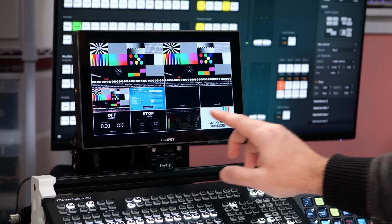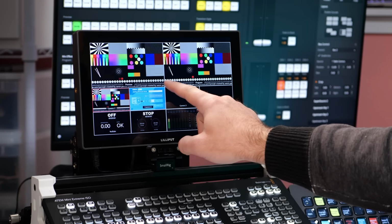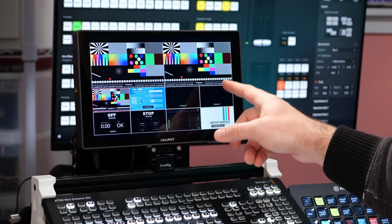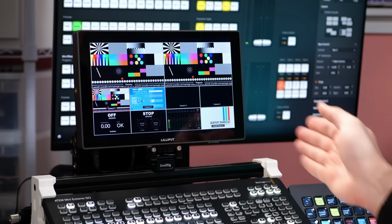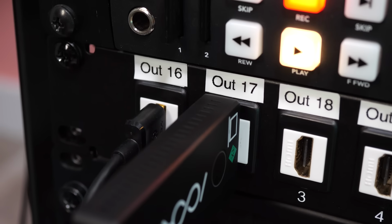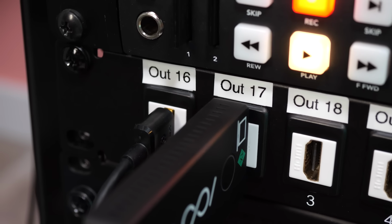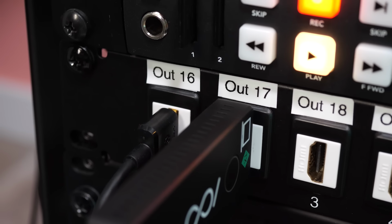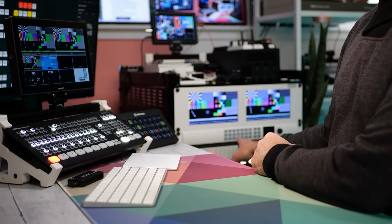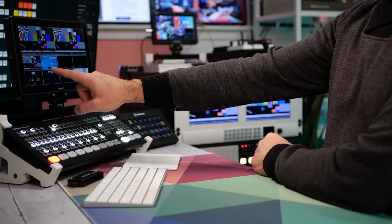So what I'm going to do is play back the stress test clip. This has a little frame counter at the bottom, so we can freeze frame this by taking a photo or pause the video to see how far apart they are from the two sources. But because I want to see only the latency added by the wireless link and ignore any latency that might have been added from other gear here, what I'm actually going to do is run one copy of the hyperdeck clip into the ATEM Mini Extreme here, directly with an HDMI cable between the rack and the ATEM Mini. Then I'm going to take a second copy of it from the rack, run it into the transmitter, and connect the receiver to input 2 here.